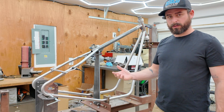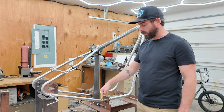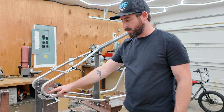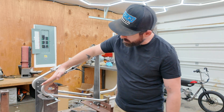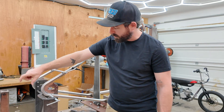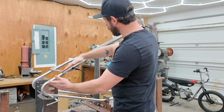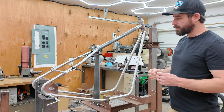The bending dies for this bender are from Pro Tools, and until CT Newman came up with their die, the tightest radius available was the one I have at three and a half inches. I normally don't like the loop-style frame because it's usually quite big, but with this bending die it's super tight. With the loop, it actually allows you to extend the line further back — normally the wheelbase would grow by four or five inches — but I have the constraints of my design, and it gives me a longer-looking tube with a straight line, which is basically the chopper ideal.